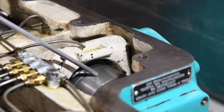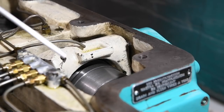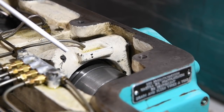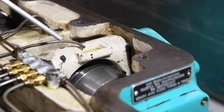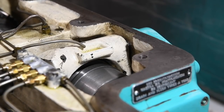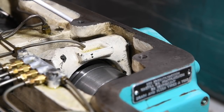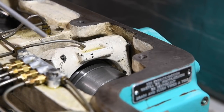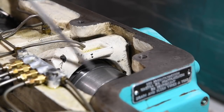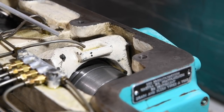Under here is the brake assembly for the lathe. When I got the lathe I cracked the headstock open before I even brought it home, and this oil tube here was aimed over the wrong way. I didn't think about how this was supposed to work — I assumed because the lathe was in such good shape that all the oil lines were in the right spot. It turns out that was totally not the case. This tube was just dripping down here when it needed to be feeding into this little trough, which feeds oil down into the groove that lubricates the two shoes.